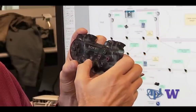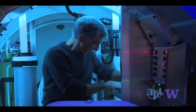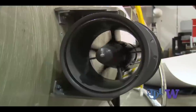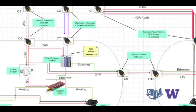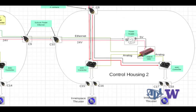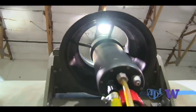This is a Sony PlayStation PS3 gaming controller, and with it you can drive the submarine — up, down, left, right, forward, backward. The main challenge was learning how the device communicates with a computer. APL's Pete Brosky designed the Cyclops control system: electrons from the controller go through about 10 different channels, out fiber optic, into a device converting to analog signal, out to a motor drive, generating high-power electrical signals to the thrusters.